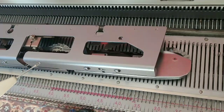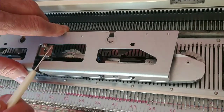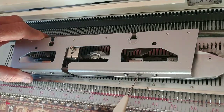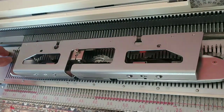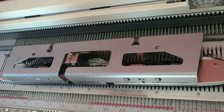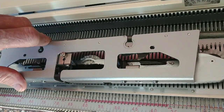That gives you a way to troubleshoot on the bed you're working on. All the beds should be the same — same gauge, same needle spacing — but you actually really need to have the sinker plate on the bed you're going to work with so you can see what the needles are doing. We had it working just fine on this side but not on that side. By watching what the needles were doing, I was able to adjust this timing cam to make it work. So what he's saying is: after you have made what look like sensible adjustments, you still may need to observe very carefully what's happening as it crosses the needle bed and tweak them slightly. Exactly — you have to have it on the bed so you can see what the needles are actually doing.